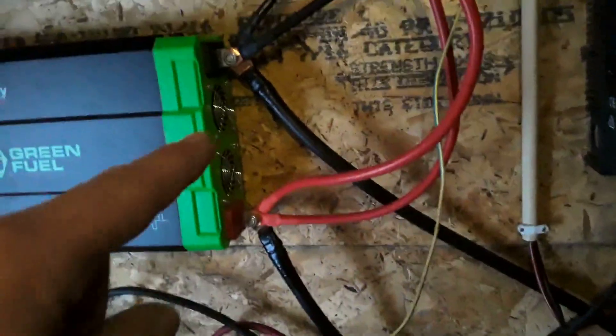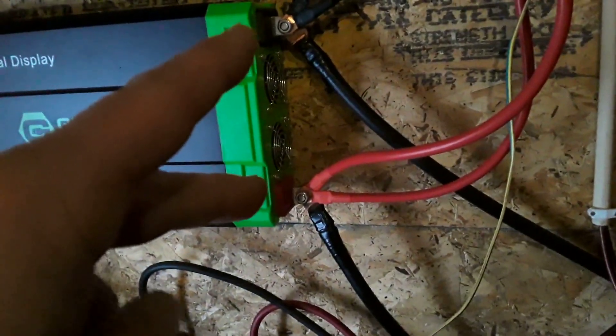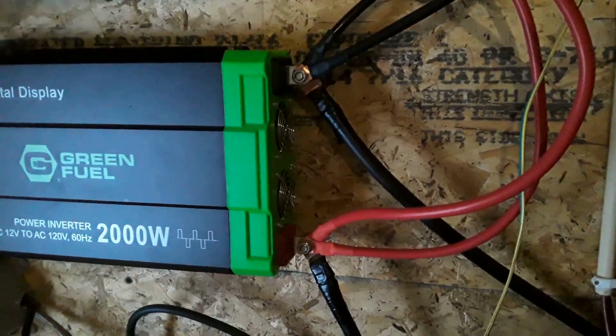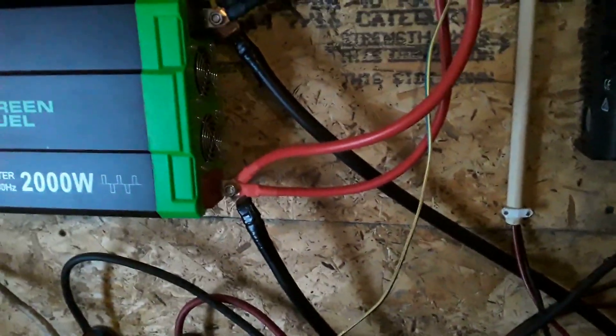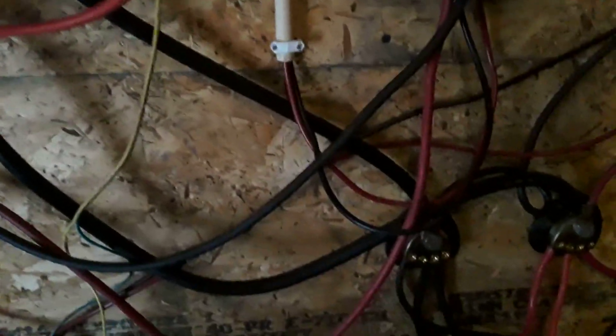I am running double-aught power cable — very fine braided. The finer the wire the better. If you get cables with very thick individual copper strands, don't use that — it's junk. You want something closer to a welding wire where the strands of copper are much finer. I probably don't need that much gauge for a 2,500 to 3,500-watt inverter, but it is always better to go over than under so you don't have voltage loss.